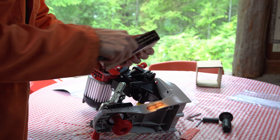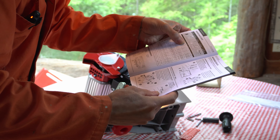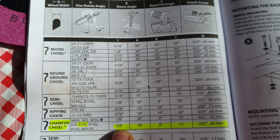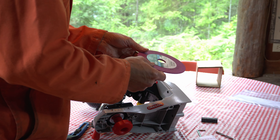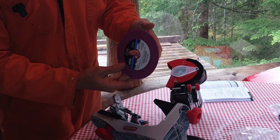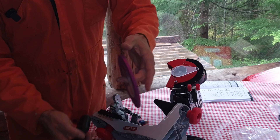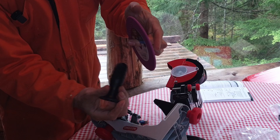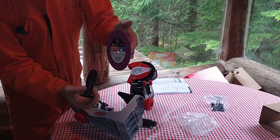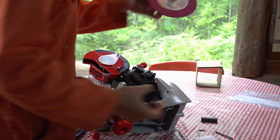Next we need to install a cutting wheel. There's a chart inside the manual telling you which size cutting wheel you need for which chain. Column X is the width of the wheel. For the chain I'm going to cut first, I need a one-eighth inch wheel. You also need to test the grinding wheel to make sure it doesn't have a fault — tap it with a non-metallic device and it should have a clean metallic sound. The eighth-inch wheel sounds a bit suspect to me; it has a metallic sound but it doesn't sound very clean. There's danger the wheel could shatter if it has a fault.